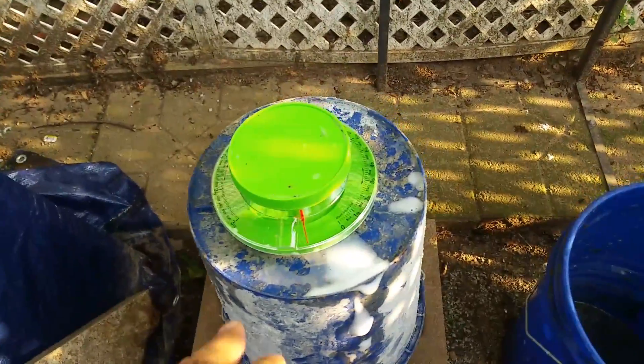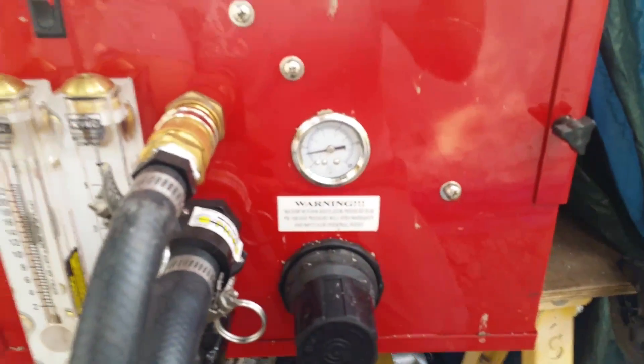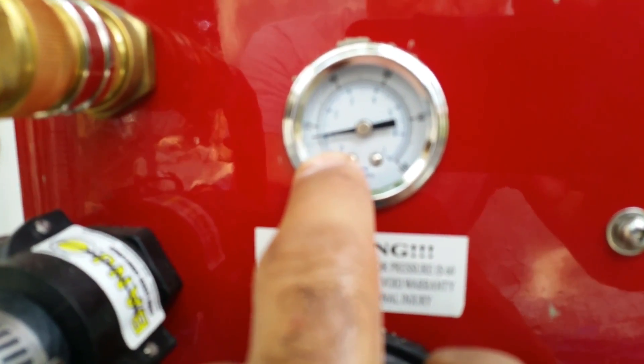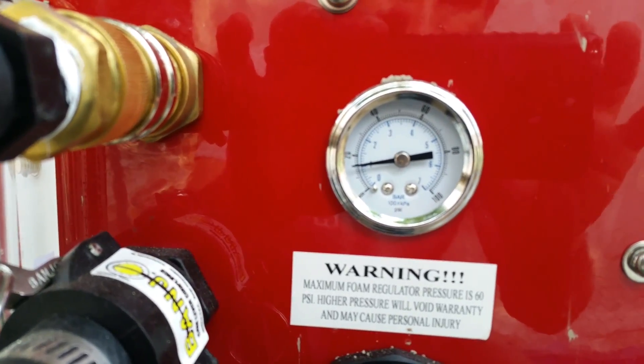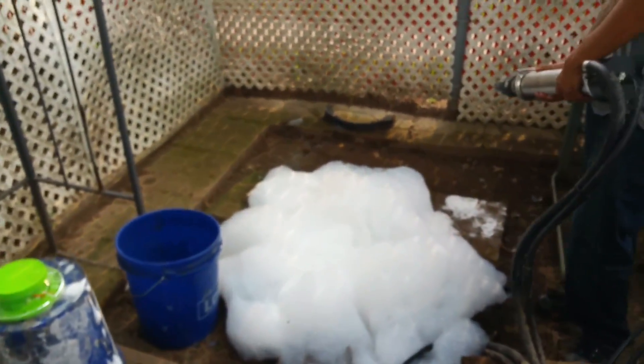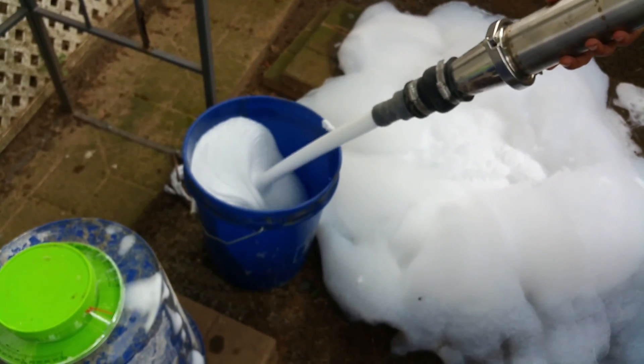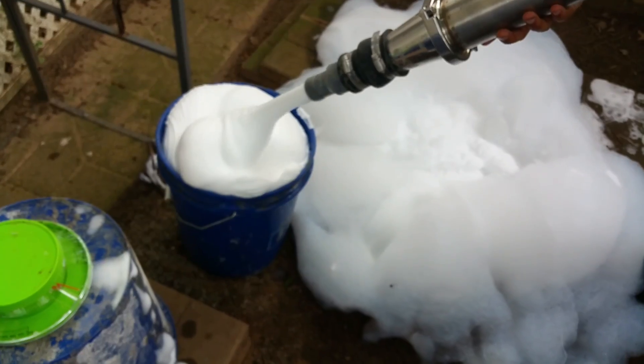To give an example, I have a five gallon bucket here with the scale zeroed out to the bucket. I'm going to fill it — you're looking to get about three pounds of foam in a five gallon bucket, which is around exactly where you want to be for a decent, strong aircrete. My new machine is set right now to around 16 PSI because I found that gave me around three pounds of foam in the bucket. I'll show you that now.